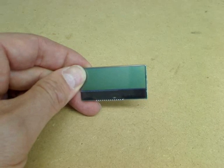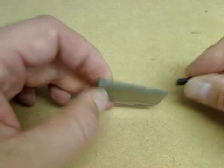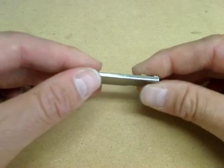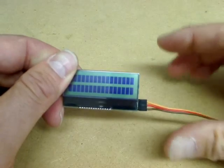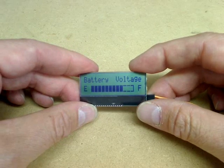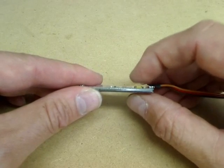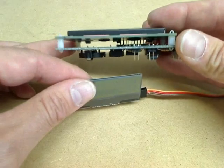This is a serial display module designed to be connected to serial ports and UARTs as you might find on microcontrollers and computers. Techstar is small and robust, covered in a transparent heat shrink sleeve which can be removed if required. The display technology is chip on glass, which is both very thin and gives a good clear display. The 0.8mm PCB is fitted exclusively with surface mount components, giving a maximum overall thickness of just over 6mm — a lot thinner than many competitors who use through-hole components and often multiple boards.